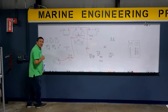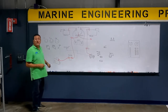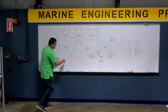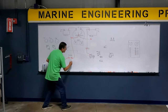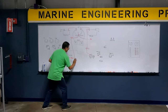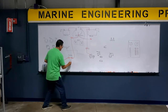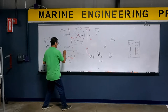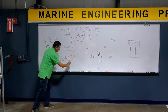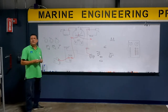I have power here right now? No. What do I need to get power here? The ignition cable — I need a signal in this terminal. Coming from the ignition bus bar. What is the color of that cable? Purple. And the other terminal is ground.